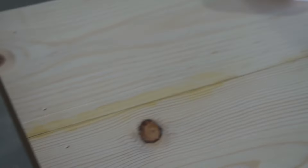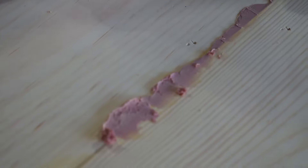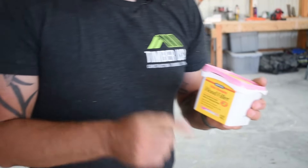Once you apply stain or paint to this, you won't see that seam. I would say this is a good wood filler to use if you're doing lower-end, cheaper projects with softwood that you're going to stain. Now, I wouldn't recommend using this filler if you're using real hardwoods, because real hardwoods typically you just clear coat or oil, leaving them their natural color. So you're not going to be adding stain or paint on top of those hardwoods. This wood filler I would not recommend for that, because it's going to dry one color — kind of a beige color — and not all wood species are that one beige color.